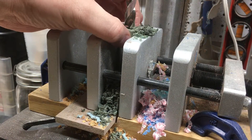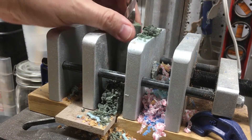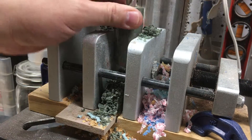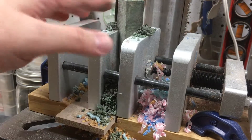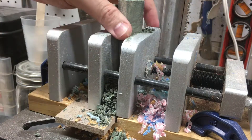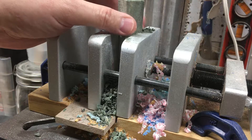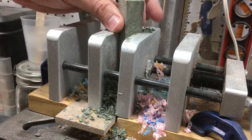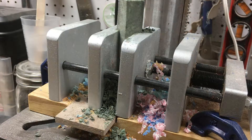I'm pretty sure I did not clear through, so I'm just going to wiggle this up on the bit a little bit — sometimes it takes a little coaxing. The grips will recenter it as it should. I can tell from feeling this that it is warm. Part of that is just the drilling process; part of that is the plasticizer — the plastic material creates more friction than would normally be the case. But it's not so hot that we're going to have a problem, and I don't have much further to go.